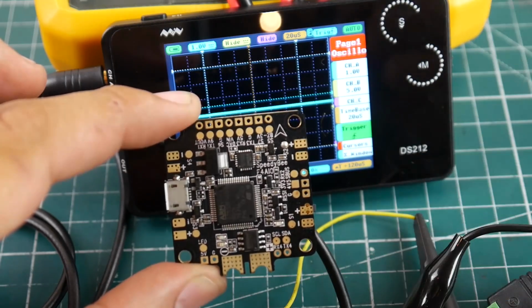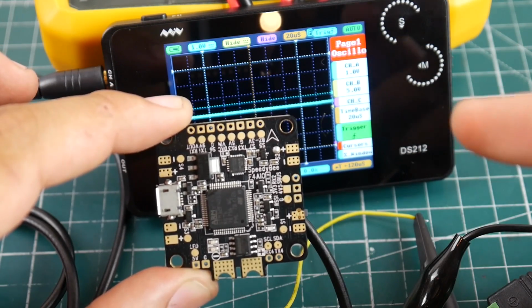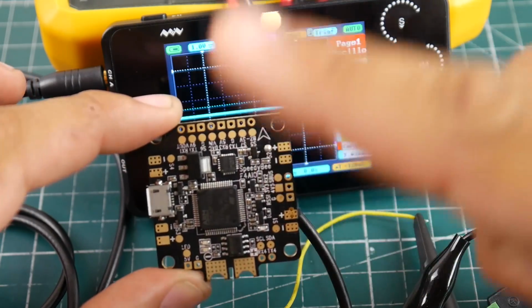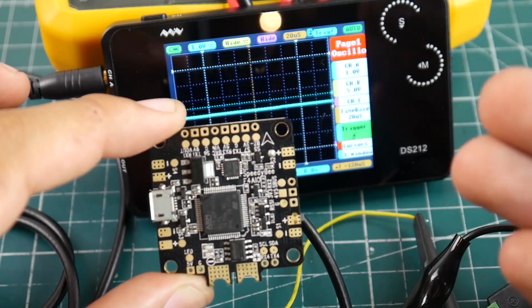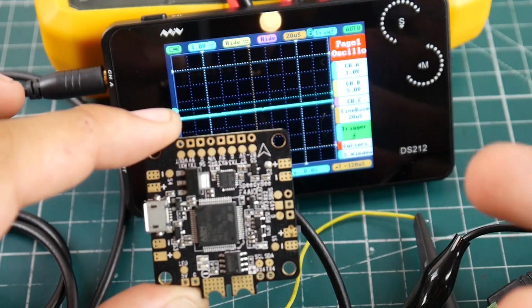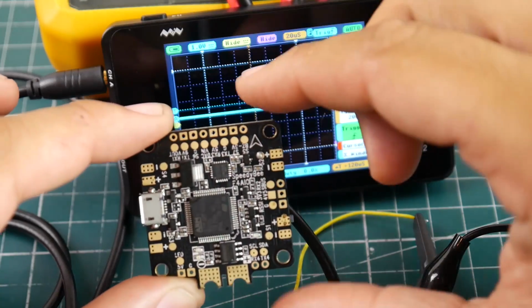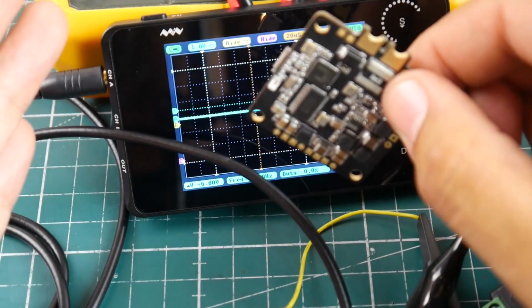And it's usually connected to a resistor. I think it's a 75 ohm or 75k ohm resistor, I forgot, and some kind of capacitor. If you could trace those back down, between the pad and the pin, and see maybe the resistor is broken or the cap is broken, you could always do that. And we'll get into that again in a separate video where we do a dedicated video for just the OSD chip. So now what we want to do is I really want to test if the OSD is working.